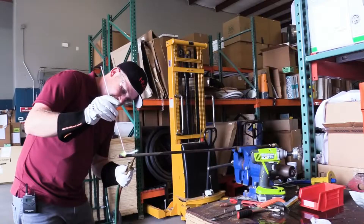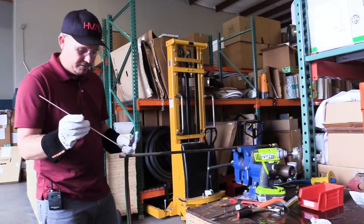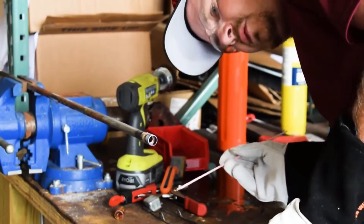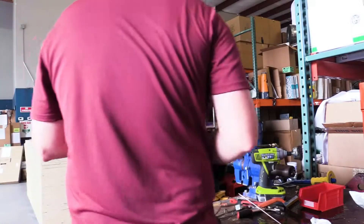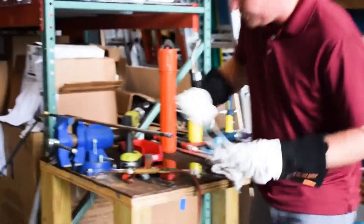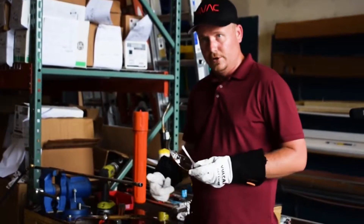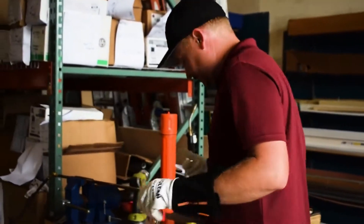You can see it's flowing all the way around — really, really nice. It's actually very easy to do because of the steel conducting heat into the joint; that flux just flows right around. And that's really all we need to do. If you look inside this joint, there's solder that's flowed all the way around right into the edge. The goal is to get the solder to pull into the joint as far as you can, and that's exactly what we've done.